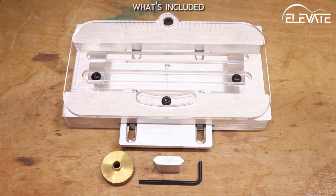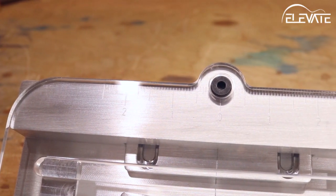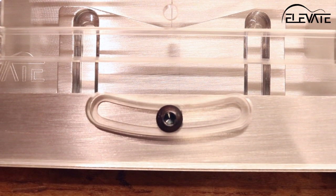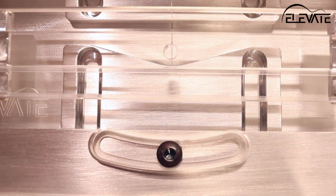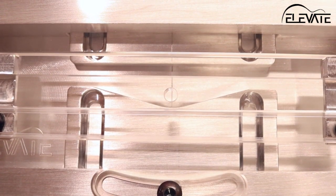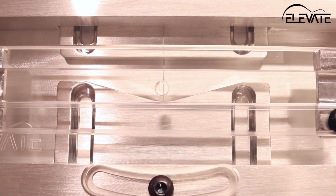The body of the jig has a few features that make it easy to set up. First is a scale on the top of the jig, which is used to set the angle of the saddle slot. Next are the two fences, one of which has a V shape designed into it so that you can work on pre-shaped bridges as well as rectangular blanks. Lastly are the movable work stops for setting the length of the slot.